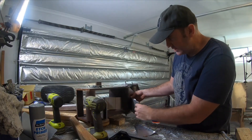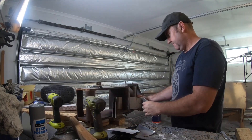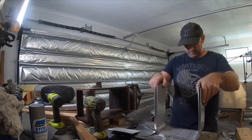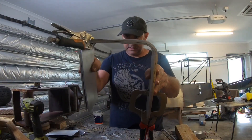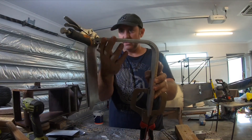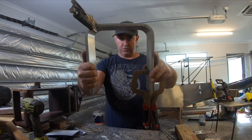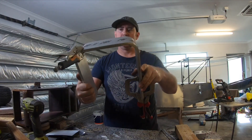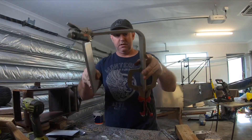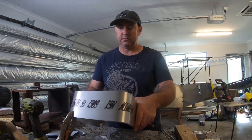It's all bent up, the fork's bent, so I'll get it out of the bender. That curve is perfect all the way — that'll be clamped in through there, so there'll be no gap there. I'll also seal it all the way, and that there is the fork for the wheel. It's come up really good. Now just shape it, clean it up, line up that axle hole, drill the hole, and we'll start attaching it to that front nose gear.